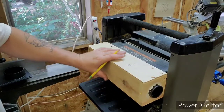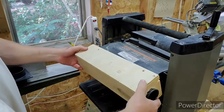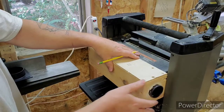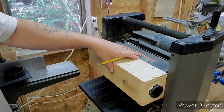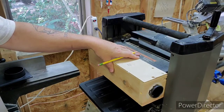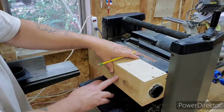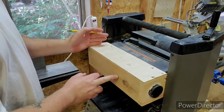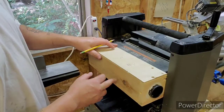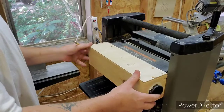It's just a box that I built that slides over the hood and screws to it, and then I had my dust collection coming out the side. It worked okay, but it's not the best setup. It tended to build up over on one side after a while, and being two inches instead of four, it just wasn't pulling chips out fast enough.